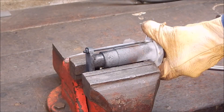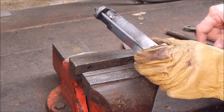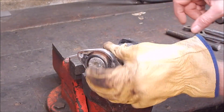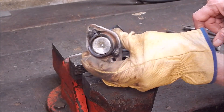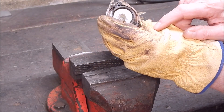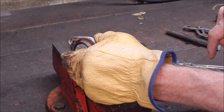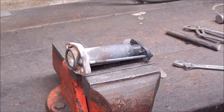Let's have a look at it. You can see what I did to the mould - I just made a plug up and built a tab on. It weeped a little bit on the bottom. I think when I cooled it down I did it a bit soon, because it must have still been a bit liquid inside because it shrank. Before I put the water on it, that was dead level. I should have left it to cool down longer.